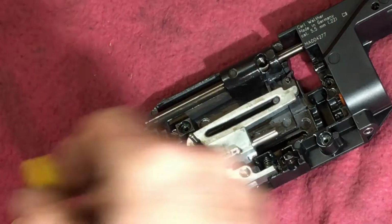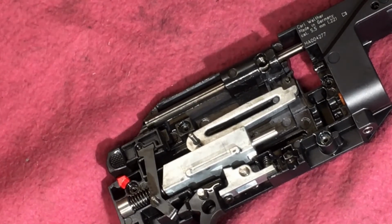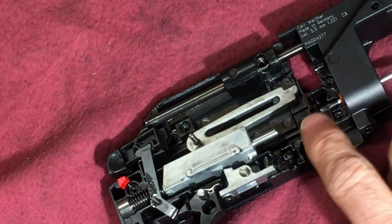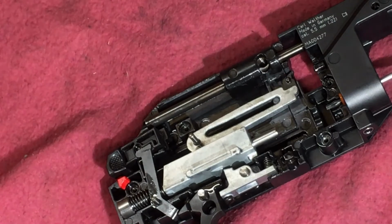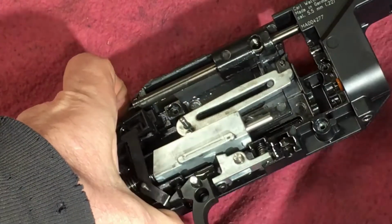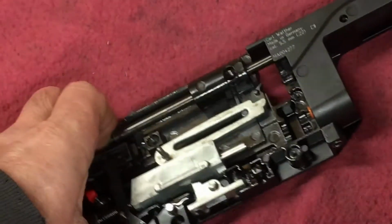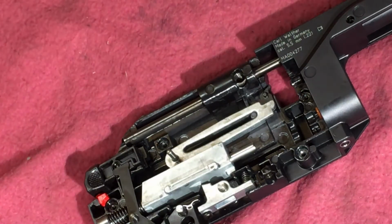And you would have a different size, smaller screw. You get a Torx bit. Don't damage the rubber. So basically, there's your air cylinder here, and then your hammer is going to tap that, and that's the valve. It just taps it, lets the air out. There's a seal here. You can see it. There's a small seal down in here which seals it, so the air doesn't come in here. It all goes straight up through the hole in the barrel. Out goes the pellet. Dead simple.